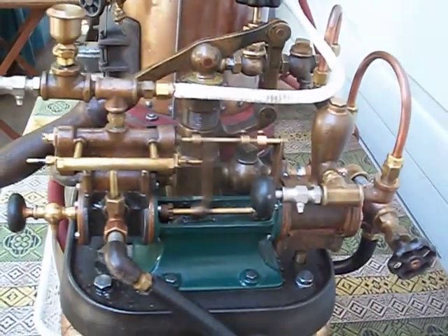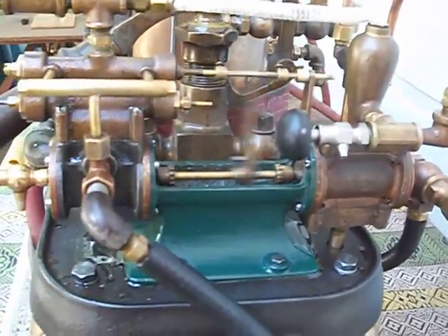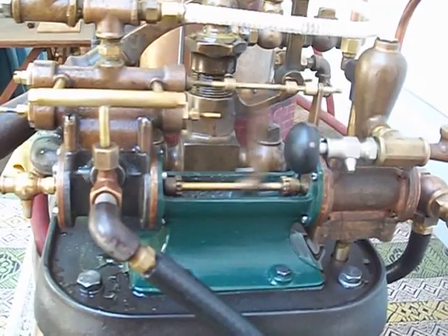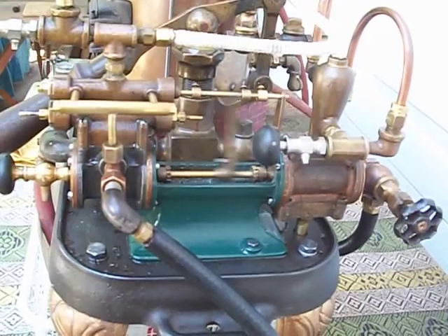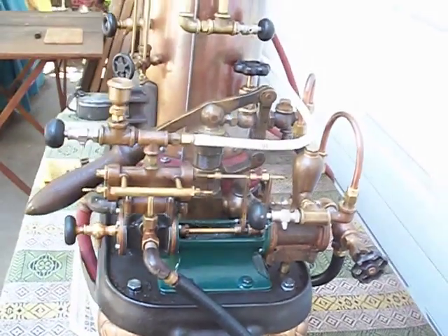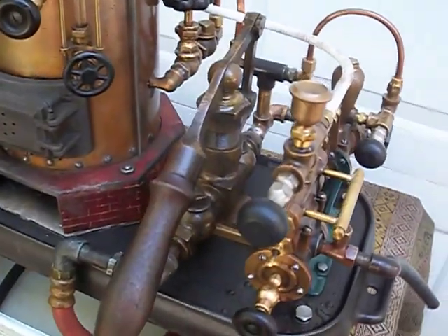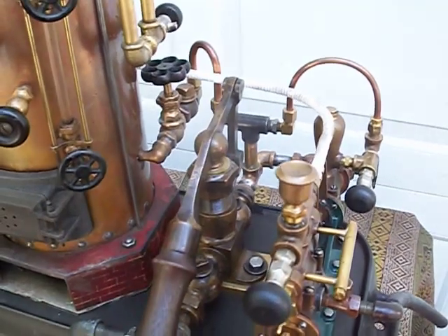It works really nice right now — it starts right up and does a fine job. It's reliable now. Just remember: if you create a pump and it runs well on compressed air, it may not run at all on steam. You'll see the bypass valve in the right-hand corner, and there's also another hand pump — it's a secondary feed supply.